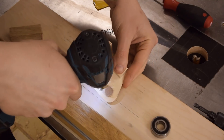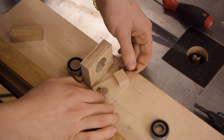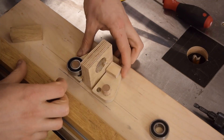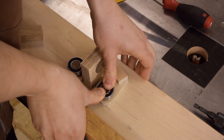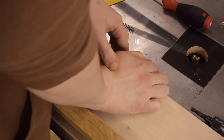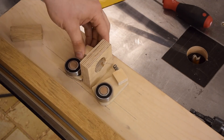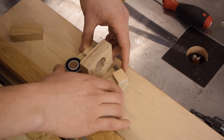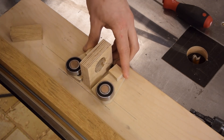After that was done I made two of these thingies that will push the carriage into the guide rail and that way take out any slack. It's the driest season right now and these dowels will, if anything, expand, which will hold these bearings securely in place. The shape of these cams gives the springs a 4 to 1 mechanical advantage. The work of these cams is really beautiful.